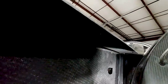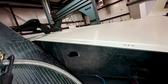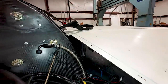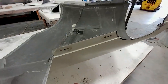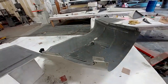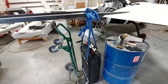Devon had, at the end of last week, put the nut plates in the wings — the trailing or root edges of the wings that mate up to the cowling — so that job's done. He also did the same thing on the lower cowling part. There are a couple of different places where we need nut plates. I looked into using other fasteners, but these ones really hold things together tight and they don't cost five dollars each, and we have quite a lot of them.